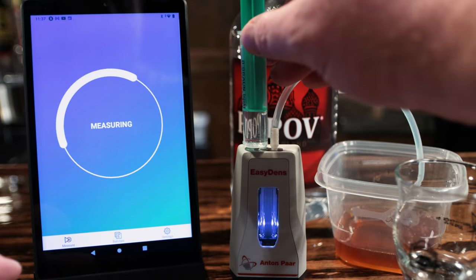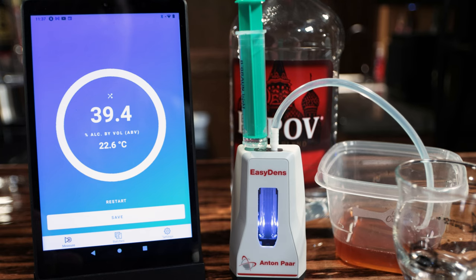As far as other functions, it will do sugar content in Brix and it will also do ABV. For those of you that make spirits, you can actually use this as a proofing hydrometer. I tested it with a cheap vodka - according to the label it should be 40% alcohol, and as you can see it came back at 39.4%, which was the highest reading. I have a feeling 39.4 might be right because manufacturers may label a little bit low on alcohol content.